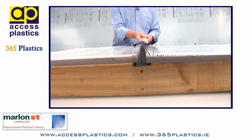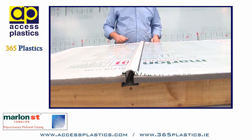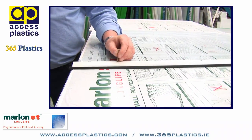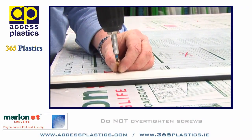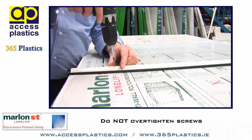The capping bar comes across the joint and the fixing screws, usually 60mm long wood screws, are placed into the pre-drilled holes and tightened down into position. Again, it's imperative that you don't over-tighten the sheet and allow for some expansion and contraction.